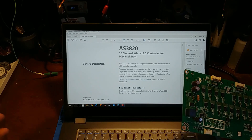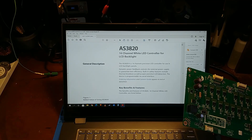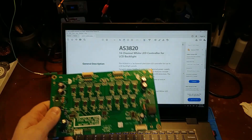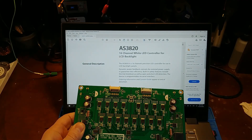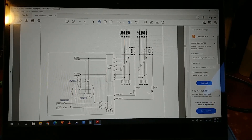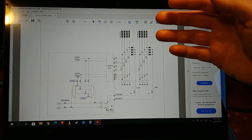Normally with a traditional LED TV it doesn't detect bad LEDs — it will just keep pumping power and go and go until it just doesn't go anymore. But not this TV. This TV has a detection circuit to monitor the condition of the LEDs, and once it senses a problem it just shuts down. The proper way to fix this TV would be to buy an LED kit and replace all the LEDs. But today we're not going to do that, thanks to my buddy Jeff for finding this page on the datasheet.